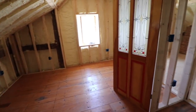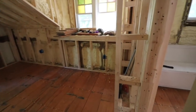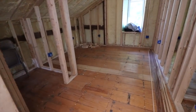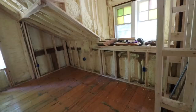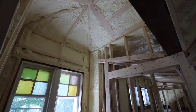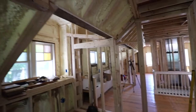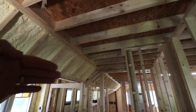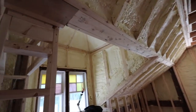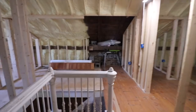Bedroom number 3 is all good. Bedroom number 2, they're all in. Bedroom number 1, they all look really good. The only thing I haven't done yet is in 2 of my bedrooms I have this really high ceiling area, and we know that we need to have a light probably back in here. If we don't put a light up in there, then when the lights for this room are on, it's gonna cast a shadow down. Same over here. Just really high ceilings. And I'm gonna put a light right there in the center. Right now I have enough plugs.